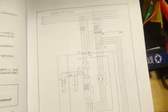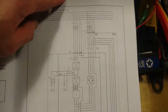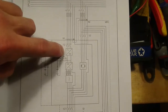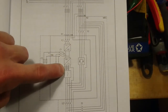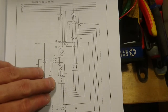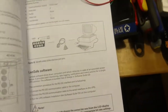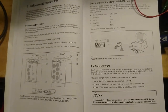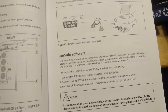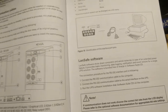Here we have a simplified schematic of the electrical wiring. We have the main input for the double conversion switches, where we first convert from AC to DC, then we have the battery banks and from DC back to AC to the load. Here we have the controlled rectifiers, and over here we have the maintenance bypass switch possibility. Some of the ports at the front — one was an RS-232 port meant for communication with a PC — providing basic monitoring, data logging, notification, and so on with the included software.